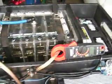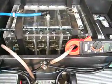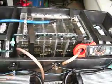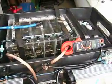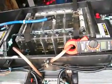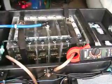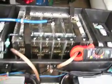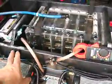I mean, I've never got this cell over 100 degrees Fahrenheit. Okay, it's never gotten any higher than that, which is unheard of for the amount of current that I'm putting in this thing. As far as I'm concerned, because as you guys know, I haven't dealt with dry cells. I don't build isolated series cells very often because the construction is too difficult and makes it too hard to replicate. So this is the first combination parallel series cell that I've designed, and I'm really enjoying the low operating temperatures.